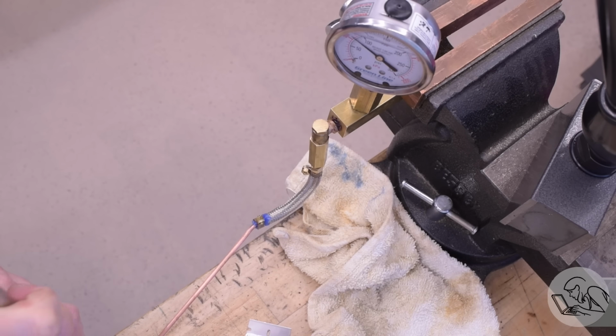I can now pump all the way up to 125 PSI, and that clamp is showing no signs of leaking. That seems to have worked very well. The other water line on the tender for the main axle pump has these same two fittings on it that might also be potential leaks that I can't test right now. However, now I know that the clamps themselves do work, and if they leak, then I'll just need to add a little bit of that silicone tape on top of them once again. So fundamentally, the design of these clamps is okay. They just might need a little tweaking in implementation.